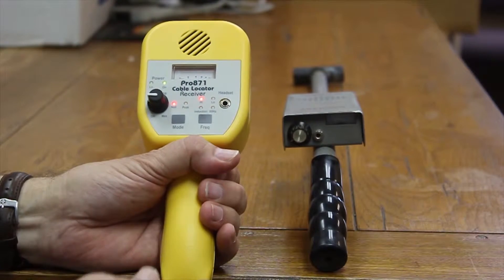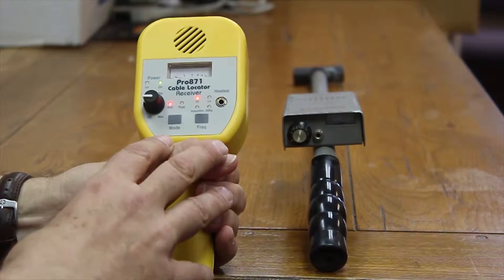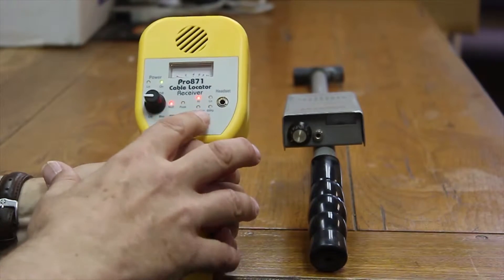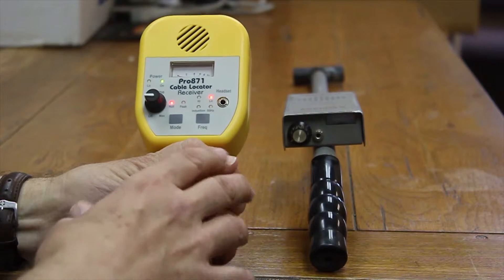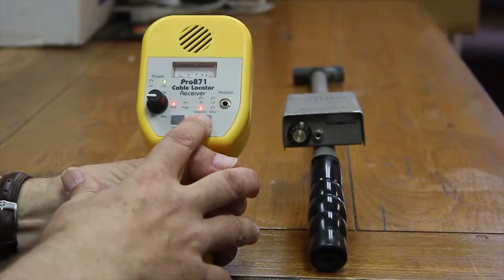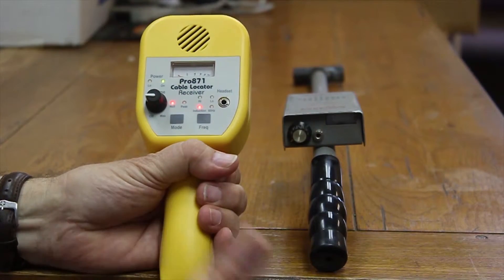The radio frequency locator — the older one — has some issues with cross bleeding and with signals jumping over gaps. We've dropped our frequencies down a little bit, so we have less of a problem with these things, and we have two frequencies to choose from to help you tailor to crowded ground situations and shallow buried cables.